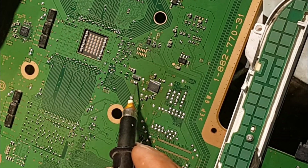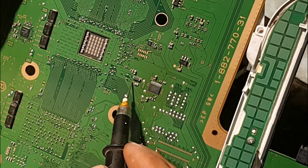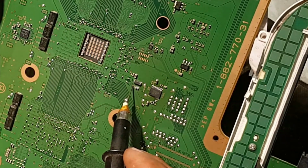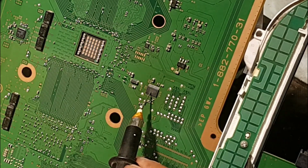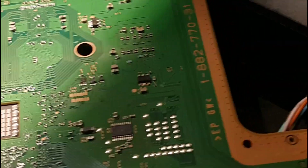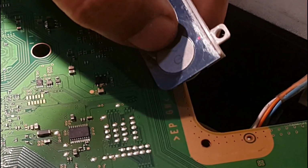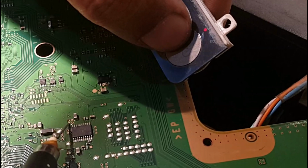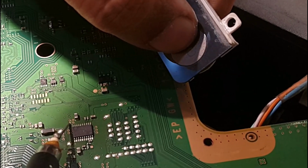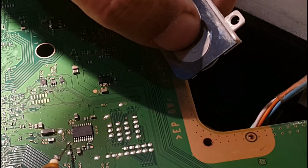It is going through this coil, this one, and it is also usable for this CPU. Now I will check for the biasing of this FET. If you can see it properly, there is the standby button, and I was checking this input. This input was 1.9 volt or 8 volt, and this was the output that was not available, and it is still not available.